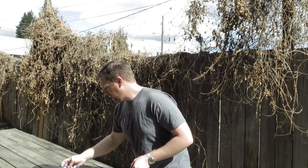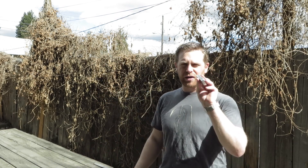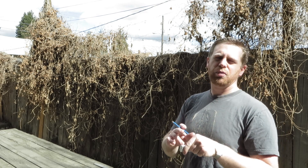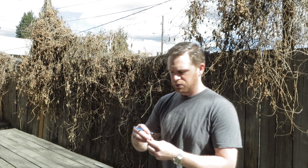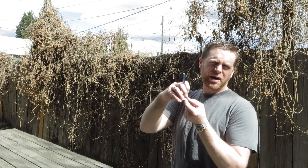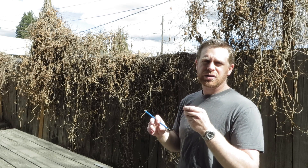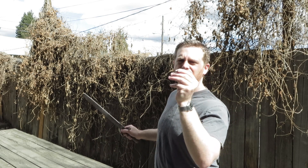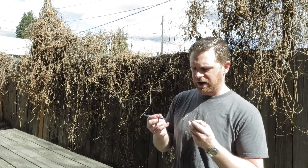Once you've done that, you need to find a flat spot on your piece of lead that you want to assess, and it needs to be an area where it's not porous. Most bullets have a sprue on the base or the tip — the sprue end is more likely to be porous, so you want to avoid that. File a flat spot on the side like I've done with this bullet here — just take a bastard file and file it flat.